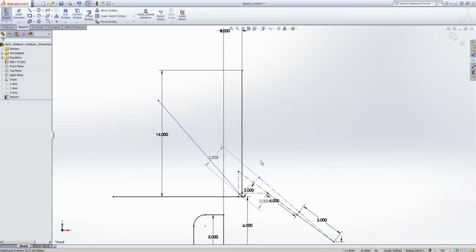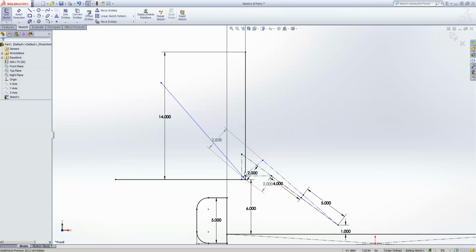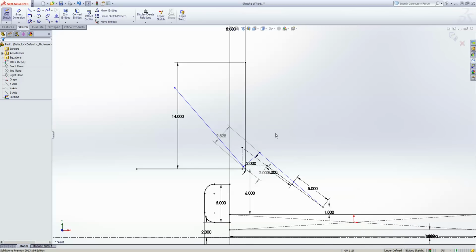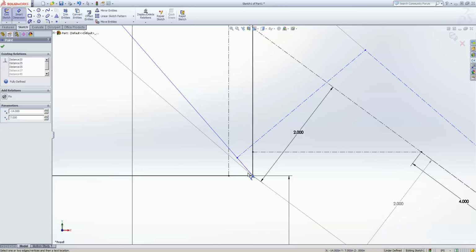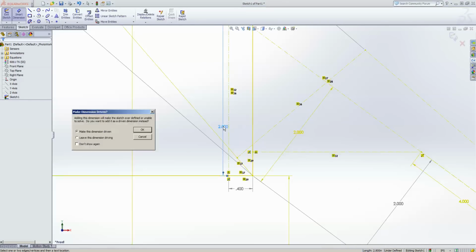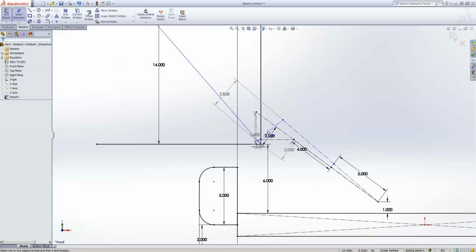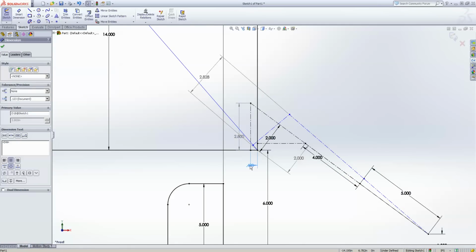So cool. You can see we've made this really simple pneumatic system to go exactly 90 degrees, and we didn't have to guess any numbers. Now there is one cost to this. You would come in at the end and go, God, to my rear pivot, I need a pivot that's 0.4 forward and 2.8 tall. Wow, these numbers are coming out suspiciously clean. I guess I have some geometry that's really simplifying things.